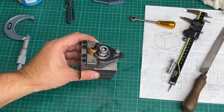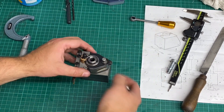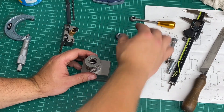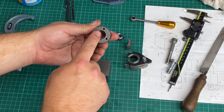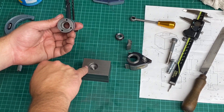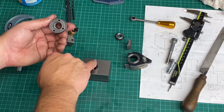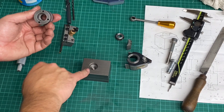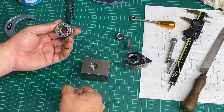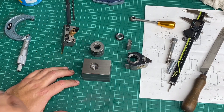Okay, so that's that together. There's one step remaining, which is to drill and pin the tool post onto the block. Under there we've got these three holes, so I just need to figure out which of those will line up to a hole position at 12 o'clock, 6 o'clock, 3 o'clock, or 9 o'clock. I'll probably put it at either 12 or 6 o'clock. That'll be an operation to go on the mill when I put the other holes through.